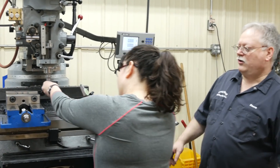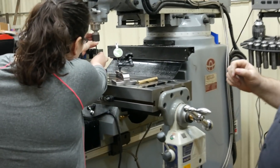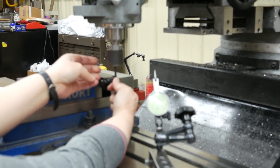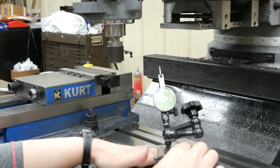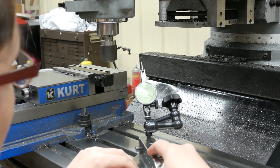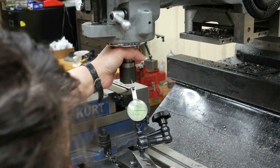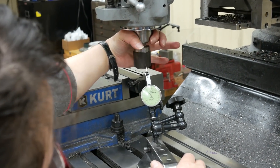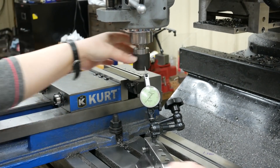I've got the mic on so I'll do the talking. Basically we've got an arbor that is fitting real close to the ID. She can just stick the wrench in there and get it just finger tight right now, because the arbor has a few thousandths in and the bushing can be out a little bit. So she's going to slide up this indicator and see where she's at.